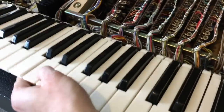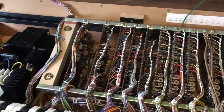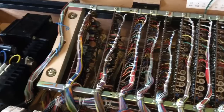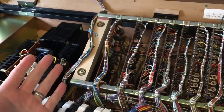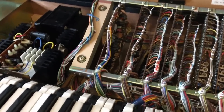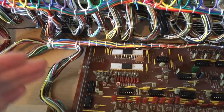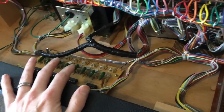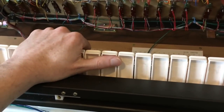So we've finished under the keyboard. Now into the voice cards. The most amazing thing is there's a big difference between the CS50 and the CS60, and I didn't realize it until I found out what these boards do - there was one board I couldn't figure out. It had the same YM267 chip on it. We've already converted the key presses into voltages, so we shouldn't need to do it again. What happens normally in a synth - and in the case of the CS50 - the control voltages go out to do the key notes, and then a copy of them is sent to the filters to do the filter tracking. This is the same in almost all other synths except the CS80 and the CS60.